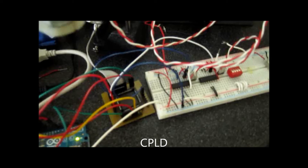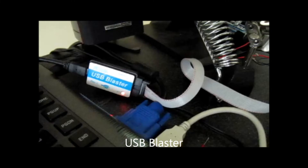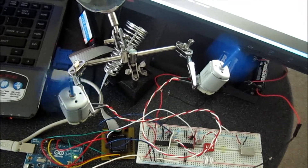My CPLD-based PWM generator will behave as the slave in my demonstration. Here is the block diagram of my customized modules used to read the information sent from the Arduino to generate the necessary waveforms. Each module was designed in VHDL. I will post the source code to Mercer's Robotics Club website. All of this code is programmed to the CPLD by using a USB blaster. Once the information is processed, the generator sends the signal to the necessary motor drivers and the motors respond accordingly.